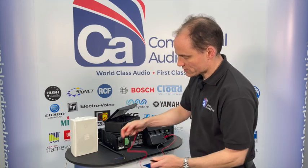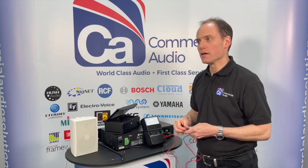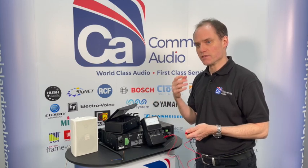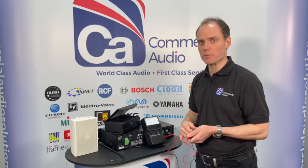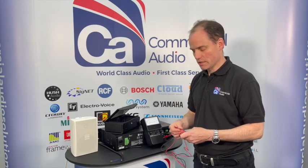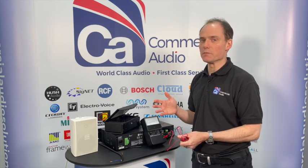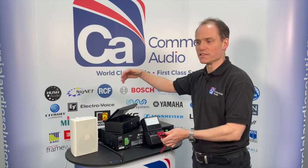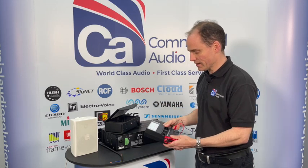One other advantage of the tone is you can actually do a walk around on the system and listen to every speaker. Obviously if you don't hear any sound coming out of a speaker, you'll know there's a fault with that speaker. If one speaker is much louder than the others in the same area, there's a potential issue with it being switched to the wrong tapping, or even to a low impedance tapping. So if you've got faults where amplifiers have overheated or gone down, it's a very useful tool for walking around and seeing which speaker might be the problem on the line. You can also find that if there's nothing after about six speakers, you know there's maybe a short circuit or a chopped wire somewhere.